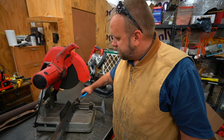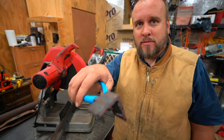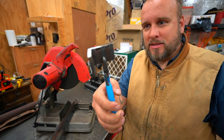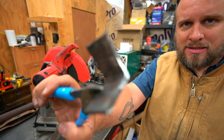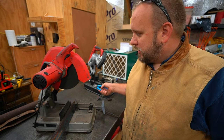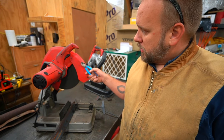That took about 32 seconds. Now you think, 18 seconds versus 32 seconds — what's the big deal? Well, if you're only cutting one piece, it doesn't matter. But what if I needed to cut a hundred of these, and you're doubling the time? Downsides: you see the smoke coming off that? That's hazardous to your health — this is probably cancer-causing, I should be wearing a mask and a respirator. Second downside, it's too hot to touch. Third downside, see how ugly the cut is? All that jagged metal makes it more dangerous — you have to take extra time to clean up these edges on a bench grinder or with a flap disc. But there is a clear advantage to this saw: the bandsaw and the cold cut saw will struggle with more hardened material, and you're going to tear up expensive cold saw blades trying to cut hardened material, whereas this can handle it a little better.